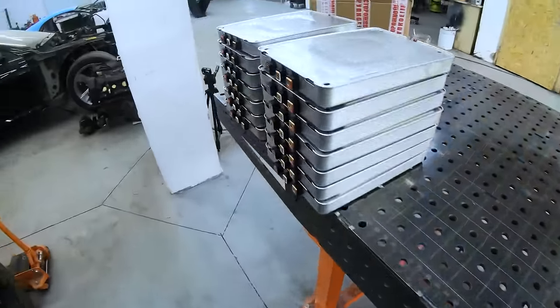We received the wires, terminals, and a special crimping tool. Special metalized corrugation will be used as a screen. The corrugation is thicker; the wire is thick - it's kg25, that's kg50, that's kg25. Now we're going to cut it all up, measure it, crimp it, and put it in the van. Then there'll be long hours of slicing, switching, crimping and other wiring work. We check and test it all once again because the voltage here is quite serious and reaches up to 400 volts.